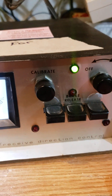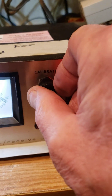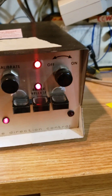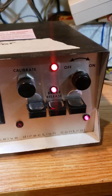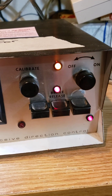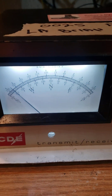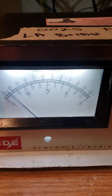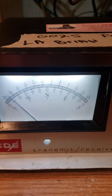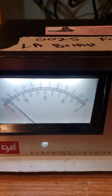But in the tail twister, watch what happens — I move it just a little bit and the light comes on but it didn't turn because it's up against the stop and doesn't have room for a backstroke. With those tail twister rotors there can be pressure on that wedge, and if it's cranked all the way over it won't do that little backstroke and release the brake.